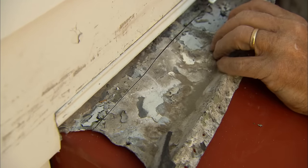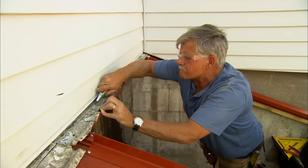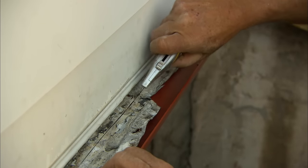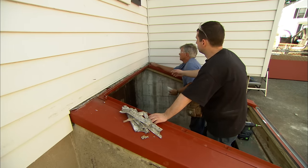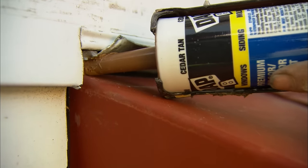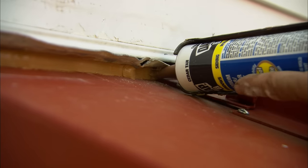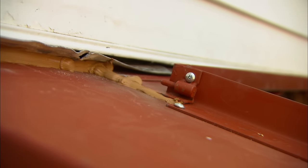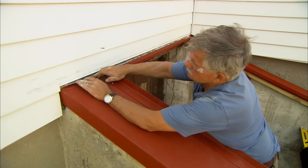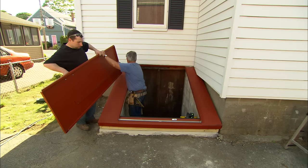What I want to do is trim it off so it looks nicer. One thing I like about lead flashing — it's nice and soft and you can cut it with a utility knife. And then we'll run another bead of caulking on each end. Now before we finish attaching the frame to the foundation plates, we need to install the doors so we can square up the frame.